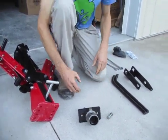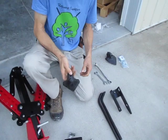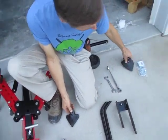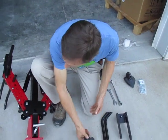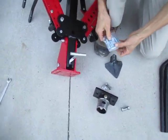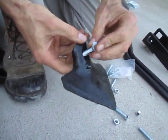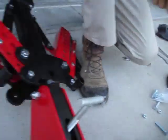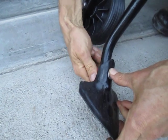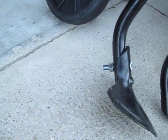Put a little grease on the hitch so it doesn't rust and you're good to go. The individual tools that go on the shanks are sold separately as well. We have anything from 1-3/8 inch chisels all the way to 10-1/4 inch sweeps and everything in between. This is a V-sweep, used for sliding along the ground and slicing weeds off — that's probably the most popular choice for these cultivators. They just bolt onto the bottom of the shanks using plow bolts, which have a flat head with a carriage interlock. The shanks come with those nuts and bolts, and you just need one wrench. You can interchange tools easily.